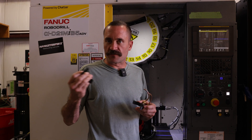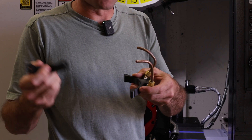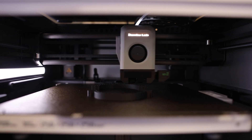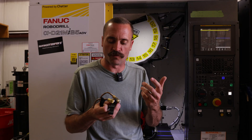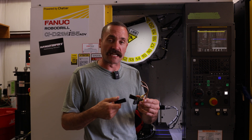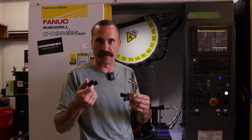So we designed, like everything in the shop, started the design in Fusion, drew it up, took it over to the Bambu printer, printed it real quick. We printed a few prototypes, right — just that whole fit and feel, trying to figure out how I wanted to run the manifold, what I wanted to do. Quickly iterated, boom, came up with something that we kind of like. Now we're going to test it before I take time to make it out of aluminum and machine it.